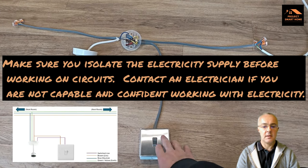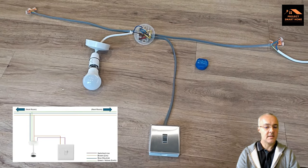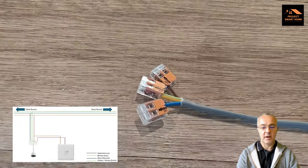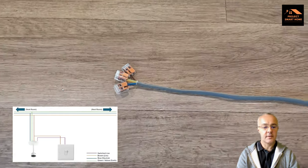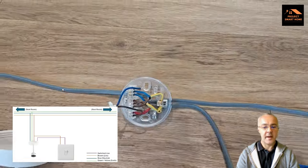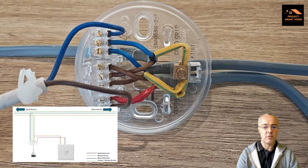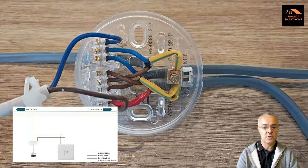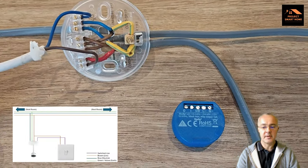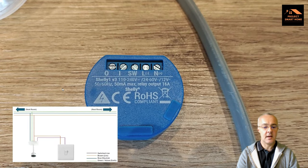I've mocked something up just to emulate what we talked about earlier. In the bottom corner of the screen you can see the existing wiring diagram, and I've mocked up this three plate configuration. We've got live, neutral and earth going to the room to the left, and live, neutral and earth going to the room to the right. We've got the pendant in the middle with the connections — the blue wires are the neutrals, the three brown wires are live, and the brown and red wire at the bottom are the switched lives: one going to the switch and one going to the lamp itself. We'll now talk through how we're going to integrate this Shelly device into this three plate setup.